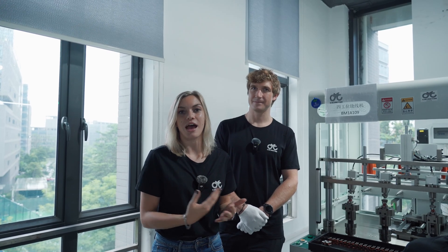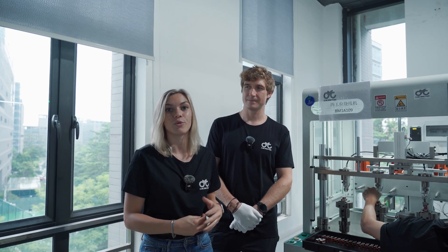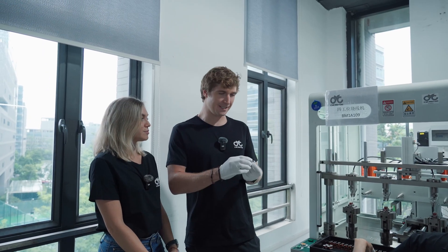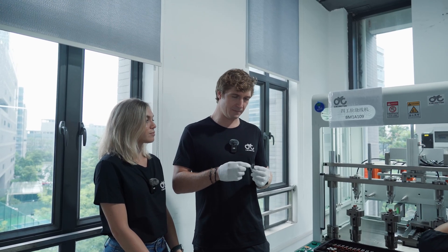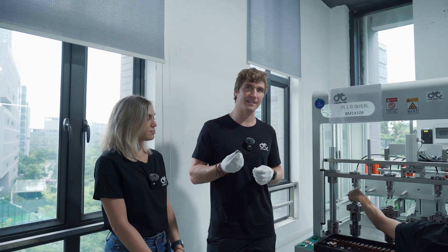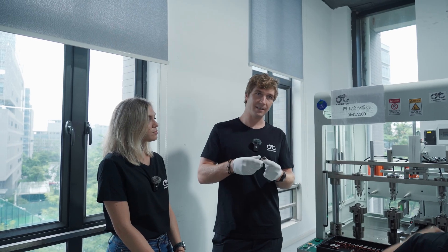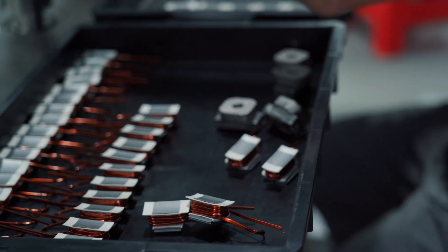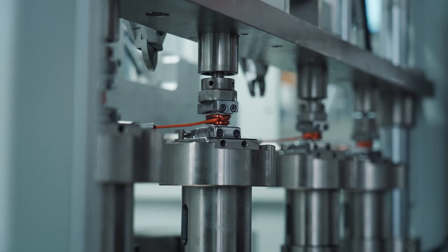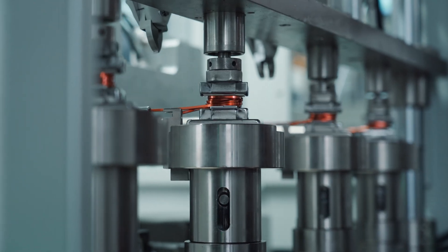The first step is to make sure that we have the motor stator and the windings all in place. Rickus, our head mechanical engineer, explains the details. The stator itself is made of individual molded plates around 0.2mm thick, all pinned together. Two plastic molded pieces go over the stator, then it goes into the winding machine. We use a specific flat-shape wire made from a custom mold, and individual stator pieces to increase the density of the copper in each of the poles inside the motor.